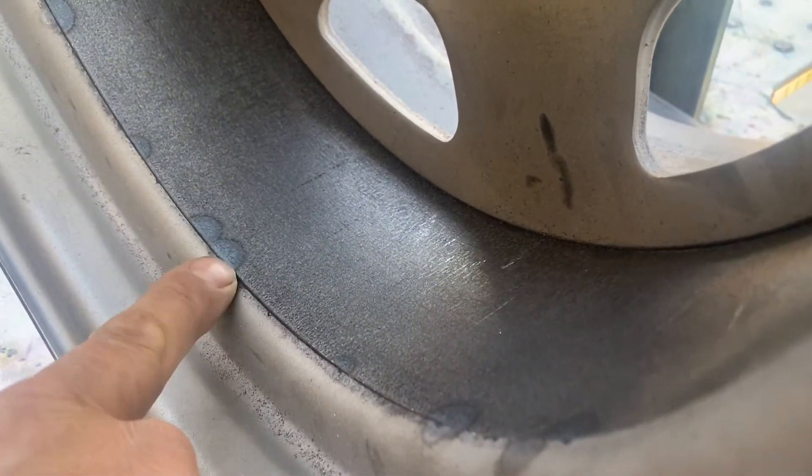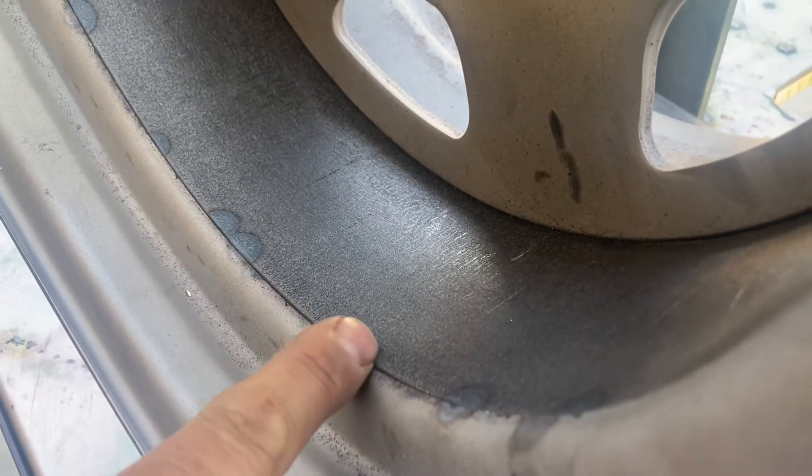That's a close-up of the outside — or inside — anyway, it's a super good seam right now but it's still a seam. I haven't decided yet how to deal with that. I think I'm probably going to braze it and try to flow in kind of like flux or solder on a pipe, fill that void, and then sand it smooth before powder coating. But I need to phone a friend and get a little professional help on that first.